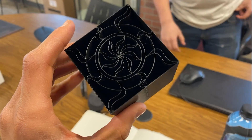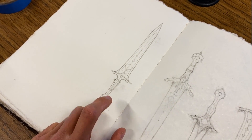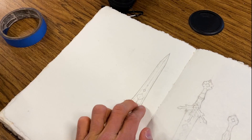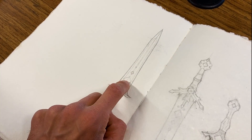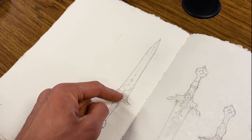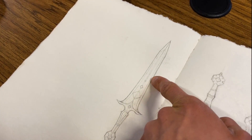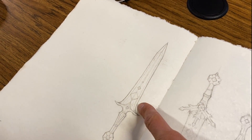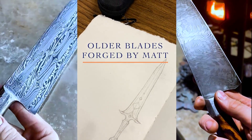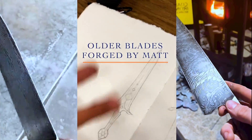So there they are — super beautiful. We landed on this because I just love the idea of the guard being integral to the blade. And then in terms of the pattern, obviously the mosaic here, and then maybe smaller, repeated — those could be trapped in even just like blade-worthy monosteel. It doesn't have to be pattern-welded in here. The penciled line could be like a thin nickel, a pop of bright nickel delineating the cutting edges, being a really dense, kind of frost-looking mosaic, or some kind of a crushed W high-density pattern.